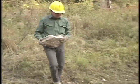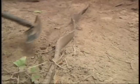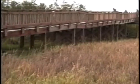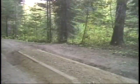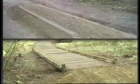Fortunately, there are alternatives, sometimes as simple as laying stepping stones, or improving the drainage with water bars, drainage ditches, or culverts. But if simpler solutions aren't feasible, costly solutions like bridges or boardwalks will have to be considered. But in most parts of the country, two other types of structures are more common and less costly: the turnpike, which creates a raised walkway using fill material, and a puncheon, a wood walkway that resembles the familiar log stringer trail bridge.